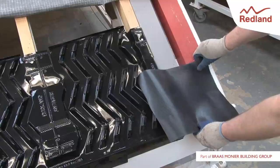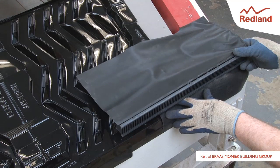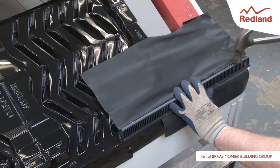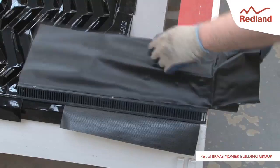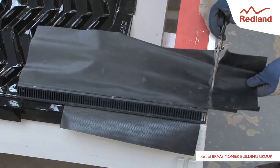To maintain the continuous skirt into the gutter, lay a section of suitable underlay material approximately 300mm wide from the gable wall to the first rafter, ensuring that the material overhangs the fascia board by 50mm. Nail the material to the rafter. Fix the first fascia grill at the right hand verge end of the fascia using three 45mm x 2.35mm aluminium alloy nails placed in the nail hole guides. Remove the excess material from the outer edge.